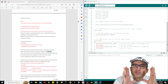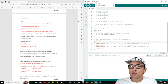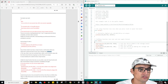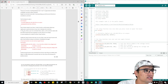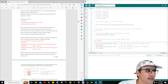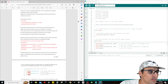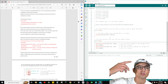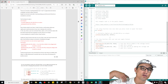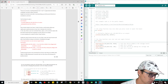In this case, there's just one command which, as the comment states, tells the Arduino board that we're going to use the LED pin as the output. It's also mandatory for the sketch to have a loop function. Unlike the setup function that only runs once after a reset, the loop function will immediately start again after it has finished running its commands — it runs over and over forever until it gets a command to stop or we turn it off.